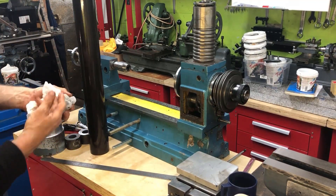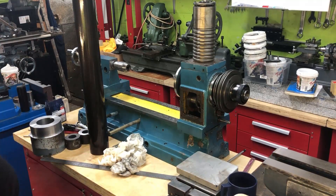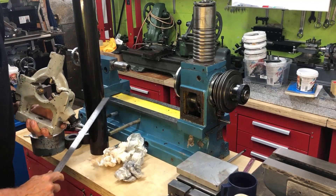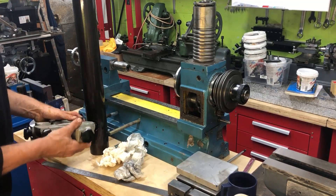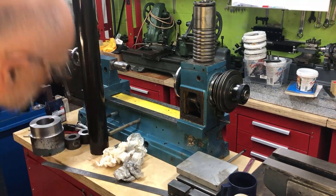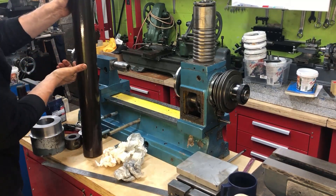Another consideration was the lathe capacity. As it turned out, I could not use the lathe steady to support the piece — being 80 millimeters in diameter, my steady didn't manage this. It has a bore a little bit less than 80 millimeters, so I had to think of something else. I reverted to a kind of bell center, a piece inserted into the inside of the tube at the end, to support it through the tailstock and run it normally from the headstock end.